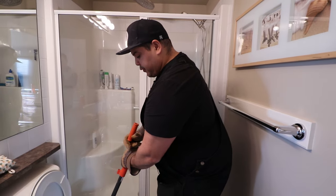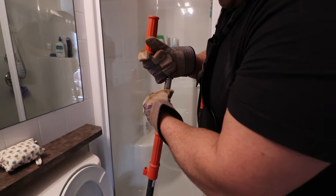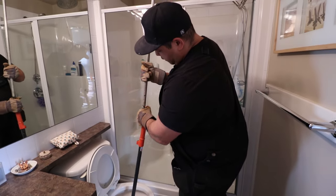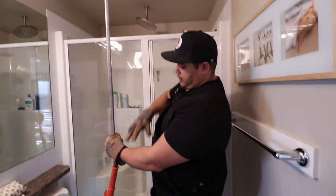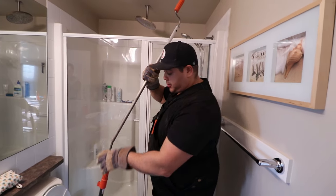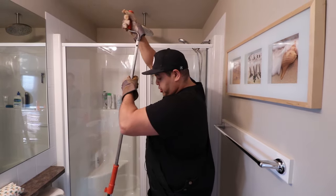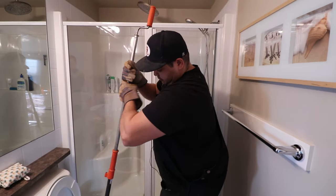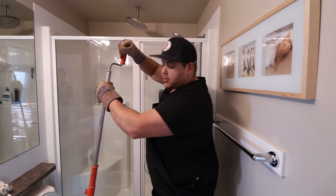With this snake you can go another three feet longer. There's a little spot here that you push, then you push it in — sometimes it's a little tricky — and then you lift this part of the snake all the way up and it'll click back into the bottom. So now you've got another three feet of snake you can push past the toilet. To do that portion it's the exact same: just push the snake in and rotate. It can get a little tricky, but you can also use the handle up top to help turn.